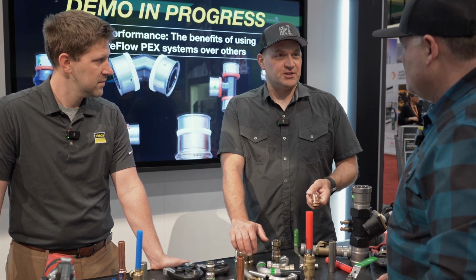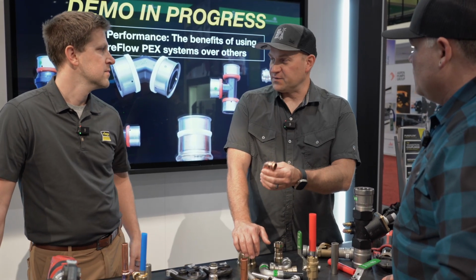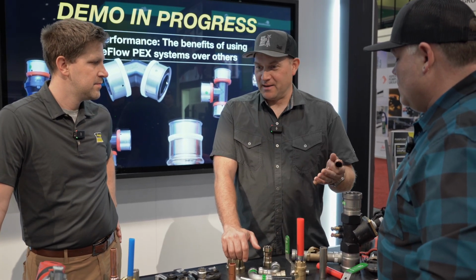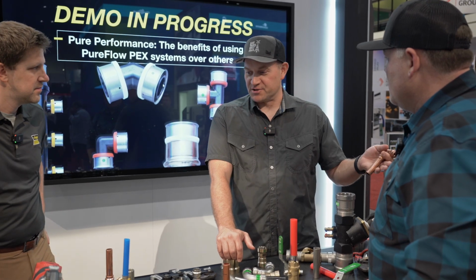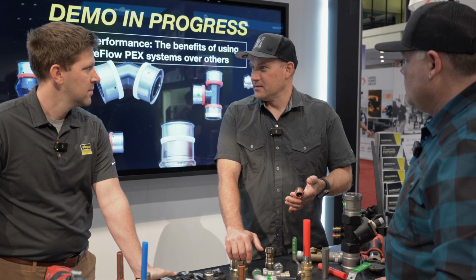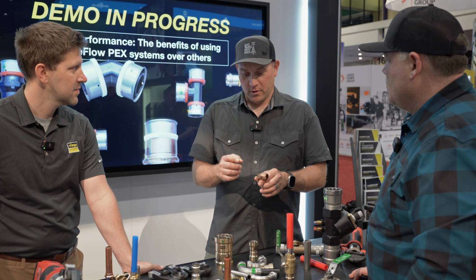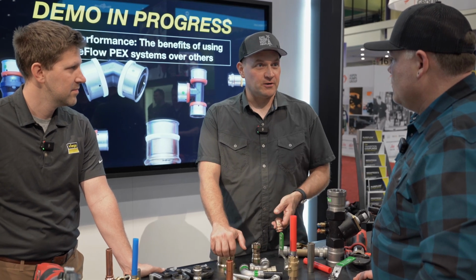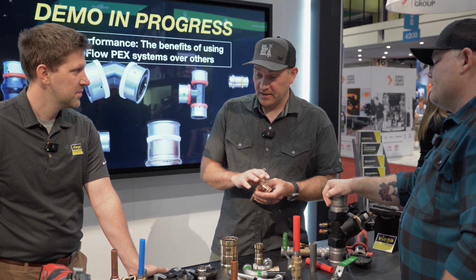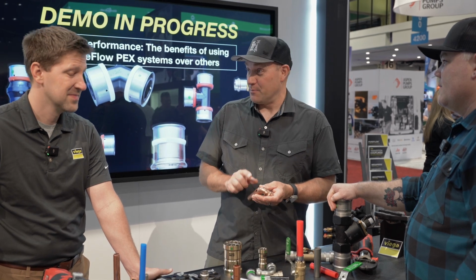We have this conversation with my customers of how many of these fittings we install and where we have issues. And I look back at my days of soldering, the first 10 years of my career, where we soldered everything. Our leak rate wasn't high, but there's no comparison. We're maybe 1 in 1,500, 1 in 2,000 presses where we have an issue with some press fitting, which is almost never because we put it together right.